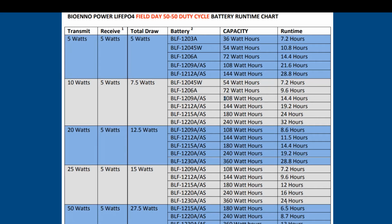Now, this is from Bioenno Power, and I'll include a link to this in the description below, a PDF document. They have two documents. One is a Field Day, a 50-50 duty cycle battery runtime chart, and the other one is a 20-80. Assuming that you're transmitting 50% of the time, listening 50% of the time, assuming that your radio receives on 5 watts. So these are things that are unique to you. Your power requirements are unique to you because you have a different setup of radio. You have a different setup of accessory items, the way you operate. All things are unique to you. So you need to find out what your individual power requirements are based on your setup.